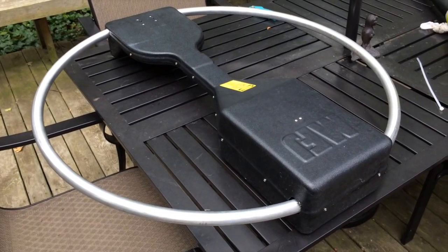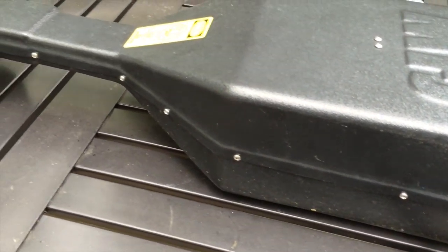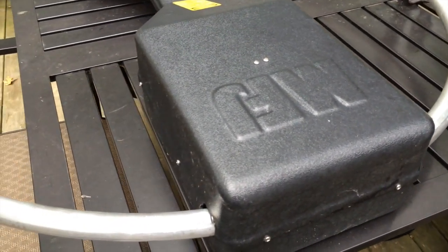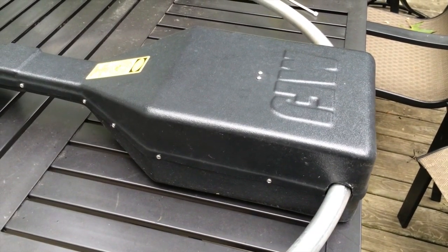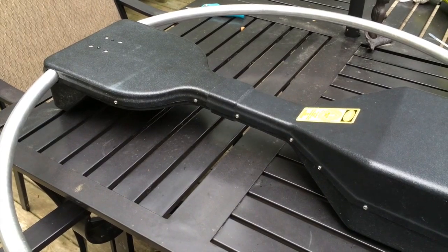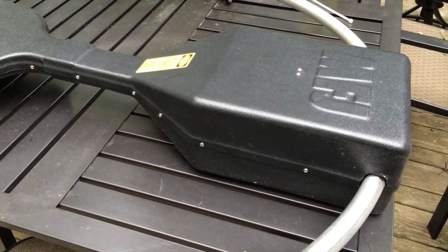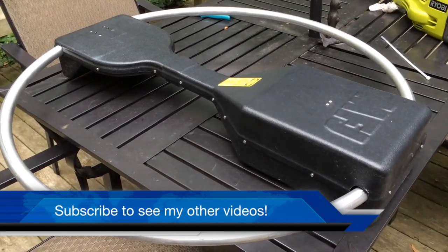All cleaned up and repackaged and ready to go back up in a tree. I was considering sealing all these holes with silicone — a lot of hams that own this antenna swear by sealing it up before you deploy it. I'm gonna argue for the opposite: I think ease of serviceability is key. I'm happy to clean this thing out every two years rather than seal it up, where bugs could still potentially get in and then you've got a problem trying to open it and service it. Might consider that yourself if you own one of these. Thanks for watching guys, talk to you later.